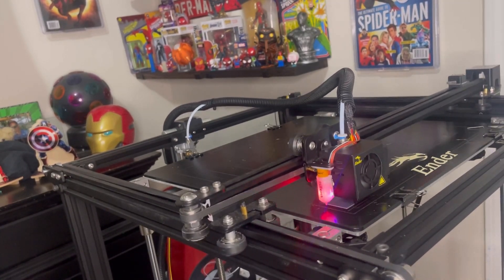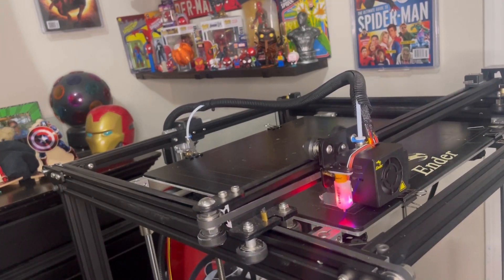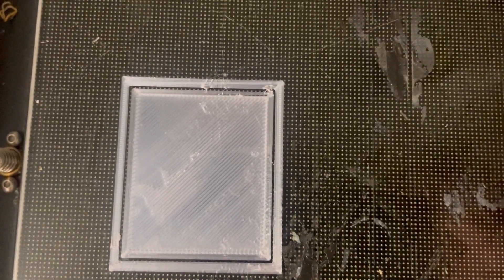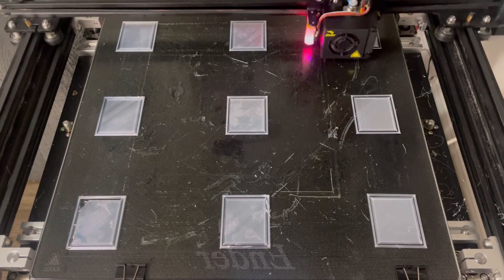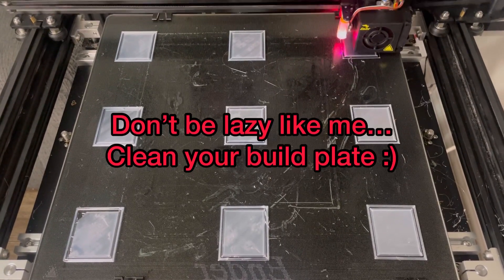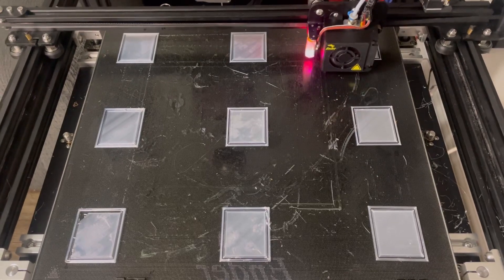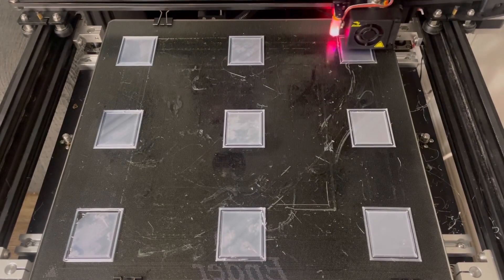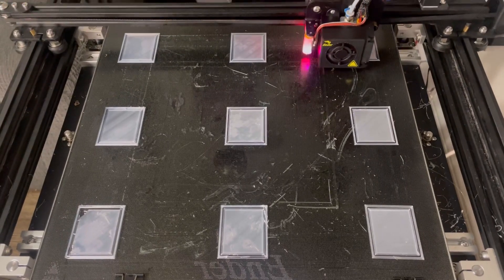The printer will print a pattern on the entire build plate that will show imperfections in your bed leveling. The one I like — I'll leave a link in the description. Once the printer runs its course, it will leave you with these patterns, and this is overall what a good bed level should look like. They're not all going to be perfect. You can see here it's a little bit close and needs some adjustments. You will need to run this test realistically two to three times. There's a very small amount of playroom with the silicone bed mount, so run this test a couple times, get everything dialed in. Once you get it fine-tuned, you usually only have to re-level your bed a couple times a year.